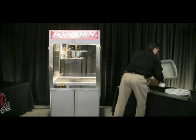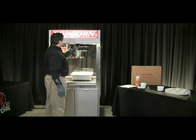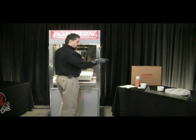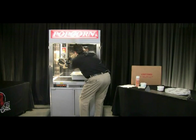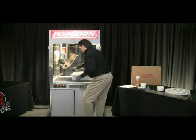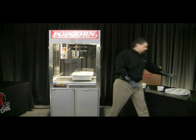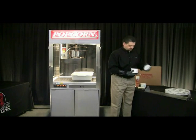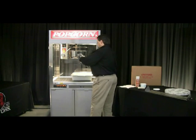I'm going to take my cleaning tub and set it down inside the cabinet of the machine. I'm going to lift the cover up. The first thing I'm going to do is go ahead and remove the stirrer blade, because we'll have to place the pad on the bottom. There's a pin here that holds the blade in place. Once you remove that pin, you can remove your blade.